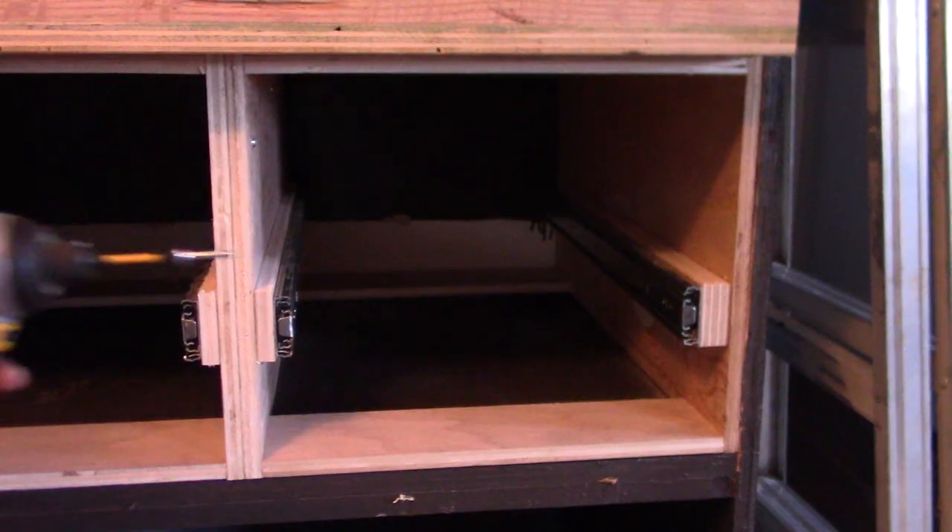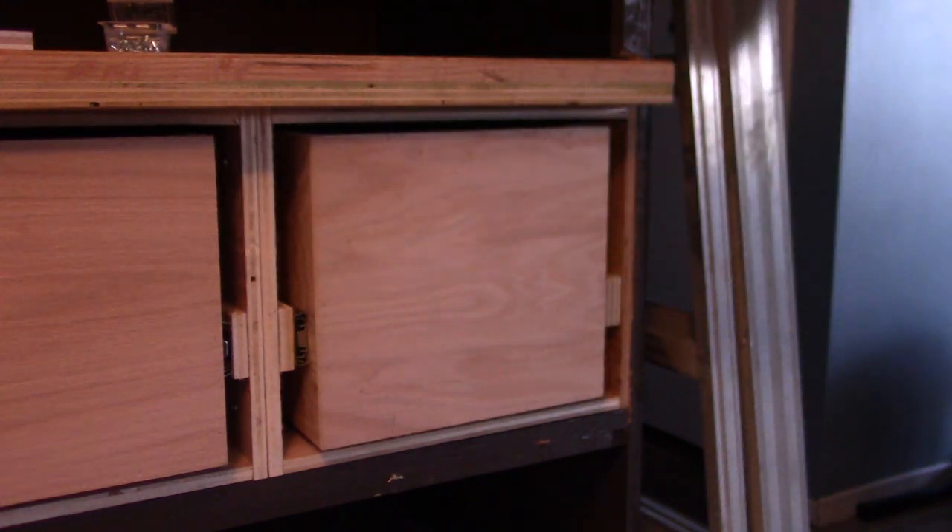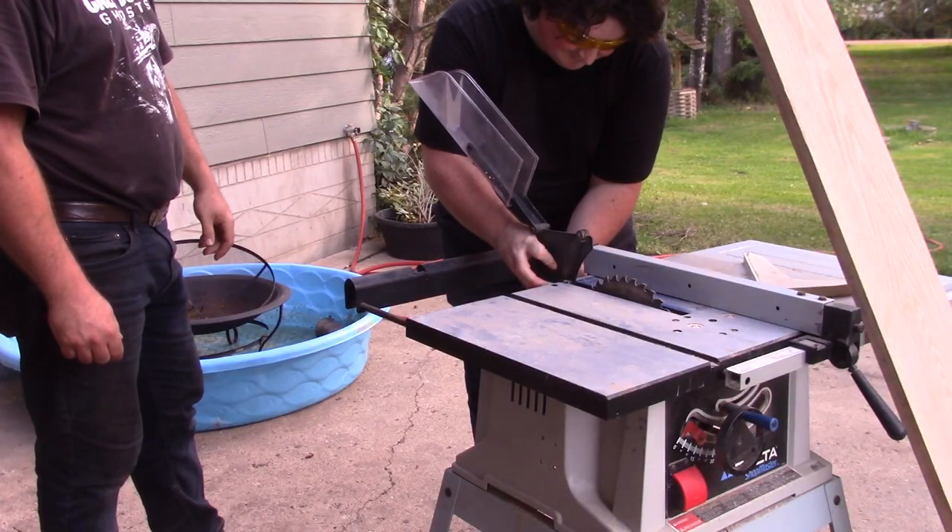This wasn't going to be needed anymore since the retrofit cabinet will take over that function once I screw it into the sides. With the cabinet now set in place, I screw the cabinet into the cavity to secure it down. Now that the cabinet is secured, I finally get the drawers installed. And now it's time for the face frame.